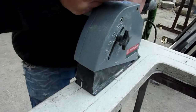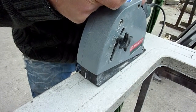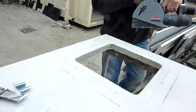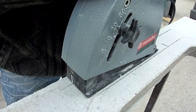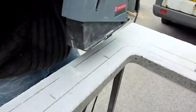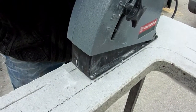The preferred method to cut the slots into which the G-Clips are to be inserted is a wall chaser, using only one diamond blade. The benefits over a handheld grinder are threefold. Firstly, and most importantly, is the dust extraction — you should take all reasonable precautions to protect your lungs. Additionally, our slots are guaranteed to be perpendicular to the work surface and cut to exactly the right depth of 15mm.